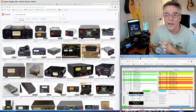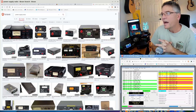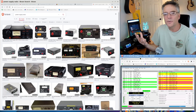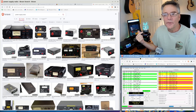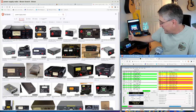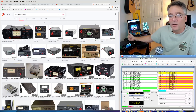Every radio is going to have a different wattage rating — watts is just volts times amps, and the volts is always going to be 13.8. A typical 50-watt radio, like a dual-bander — a Yaesu or an ICOM, something you put in your truck — I just measured it and it draws about 8 amps. An HF rig like the ICOM 7300 here is a 100-watt output radio, and I've seen it come up to about 20 to 25 amps at most.